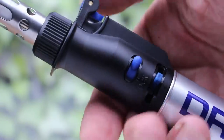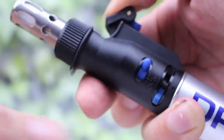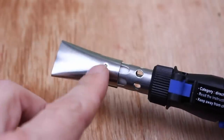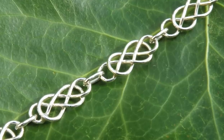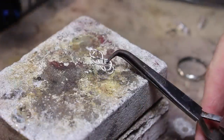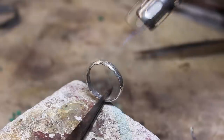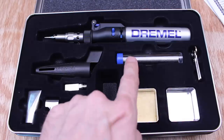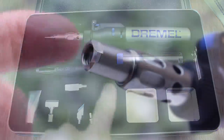Just note that you can't lock the gas open until the trigger is back and the flame is lit — that stops you wasting all your gas. For detailed paint stripping you can also pop on the wide flame head, so you've still got an open flame, just wider. When I first started out making jewelry, all of my Celtic chains were made with a small butane torch just like this one using silver and gold solder. Remember, when I talk about jewelry soldering I mean using silver and gold solder — don't ever use the electrical tin solder on precious metals. The solder here is just for electrical work.